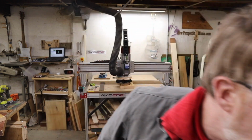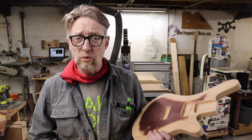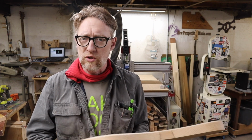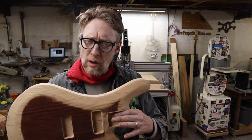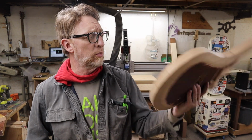And now the other thing you'll notice too, like if you're working from CNC and you're not comfortable with all of the 3D stuff on the CNC, you could do all of this with a 1/4" end mill and just not do the 3D parts. You could just open up the DXF files and whatever software you're using, cut those pockets to the depths that are mentioned in the pamphlet that comes with it, and then do all the 3D shaping by hand, like the old-fashioned way. That's how I actually started doing it before I got more involved in experience with CNC woodworking.